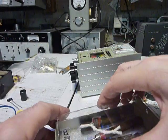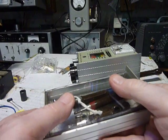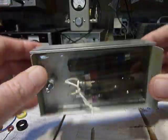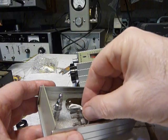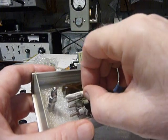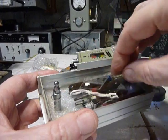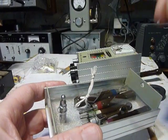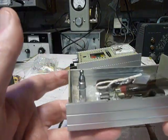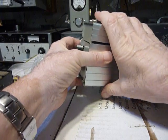I just lay the coils down in there, then put this in, squeeze it so it fits tight, and push it down. Coils are all fastened in there properly — they don't come out and go all over. They might rattle a little bit but that's okay. And I put this piece of string in there: I drilled a couple of holes and just put a piece of thick string in there and tied a couple of knots in it, so I can grab a hold of that and pull it right out without having to fish for it with a screwdriver. I wanted to show you guys that — if you've got a tunnel dipper you might want to do that. It sure works nice.